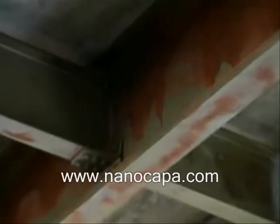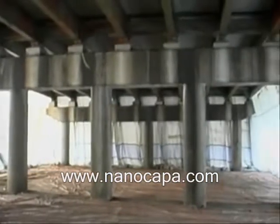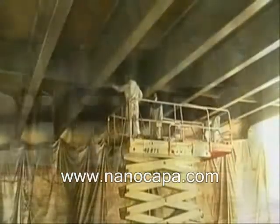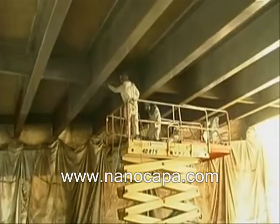As you can see, after pressure washing the support structures, a fairly extensive coating of rust still remained on them. But with Rust Grip, there is no need to remove this rust or the existing bonded paint. After cleaning, a single coat of Rust Grip was applied to 8 mils wet, 4 mils DFT.